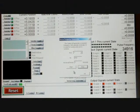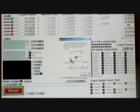After investigating the problem, which was traced down to idiot factor — I had forgotten to plug in the motor — we're now running at 500 Hz on the Y axis and the platen is going forwards and backwards. This motor is a lot smaller than the carriage motor and it doesn't seem to vibrate as badly at 500 Hz; in fact it doesn't vibrate at all. Let's increase that to 1,000 Hz. You can hear in the background it's now changing at 1,000 steps per second.